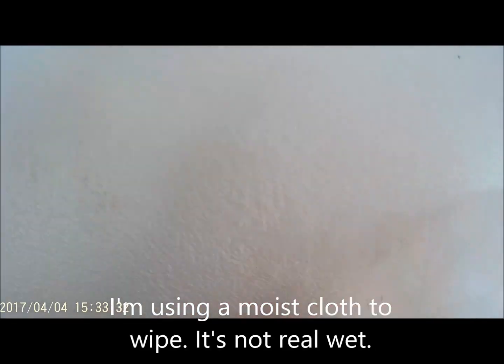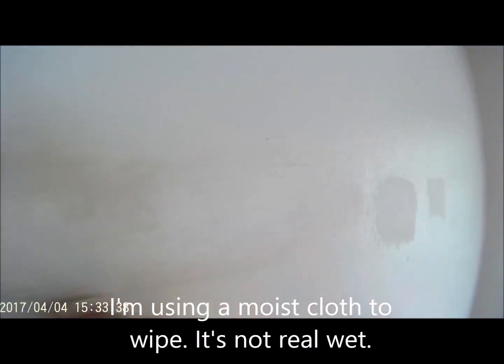If you take this, I'm being careful. I'm just applying pressure along this edge. I'm not trying to wipe out everything else. So what I'm trying to do is feather this out. Maybe I didn't get it quite the way I wanted. But you can take a rag, a sponge, and I'm just kind of concentrating on the edges, leaving the body of this thing alone. And what I'm doing is I'm feathering it out and I'm avoiding the sanding.